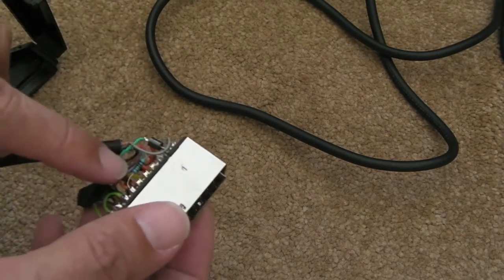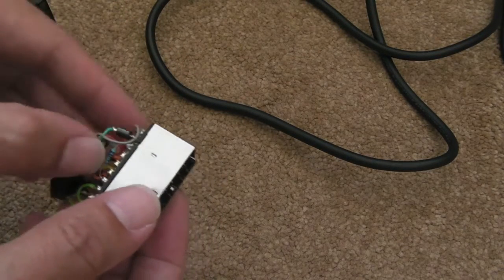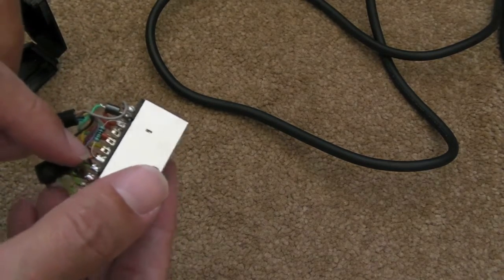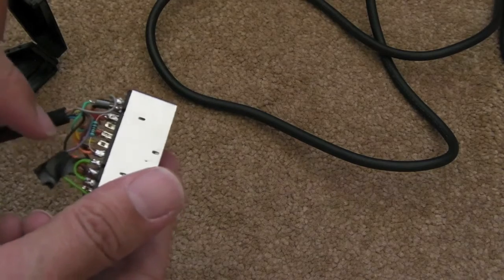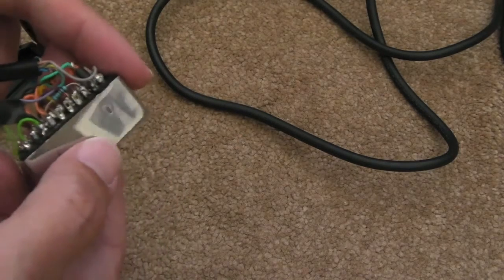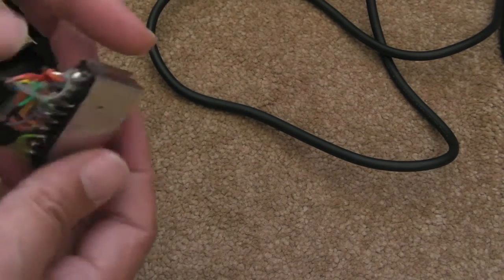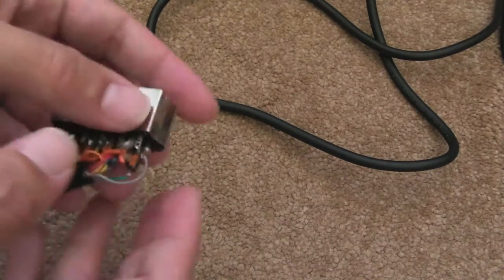You'll see I've got a little resistor there - 150 ohms, just between pin 8 and pin 16. You've got the 5 volt coming into one of those pins. It's probably pin 8, and then it goes via a resistor to pin 16. And that switches it into RGB mode.